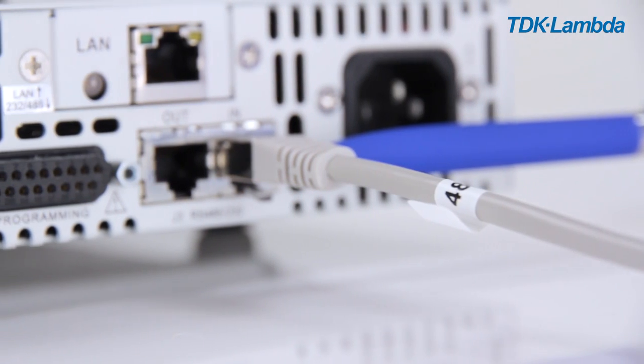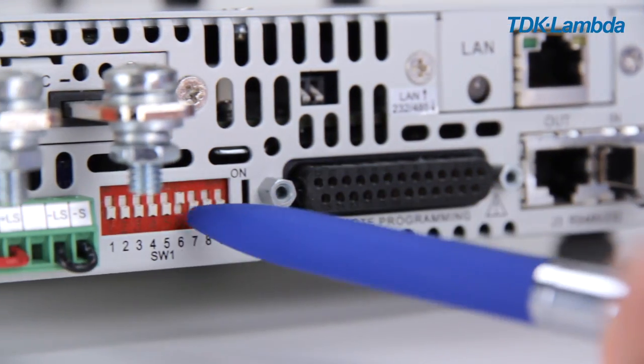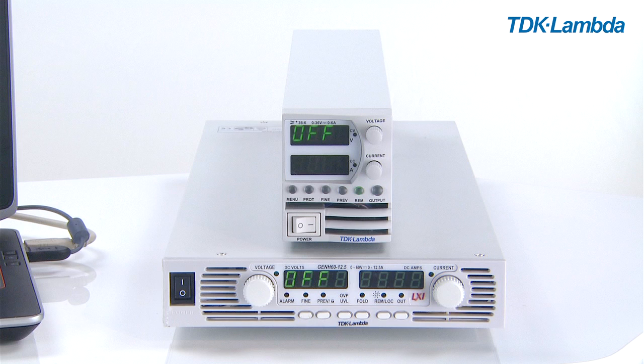You need to remember to set the Genesis to receive RS485 on the nine-way DIP switch here. Also you need to select the language used to communicate and make sure the same baud rate is set for both devices.